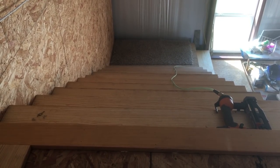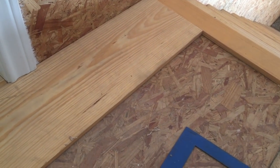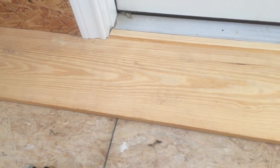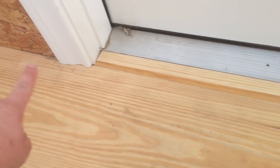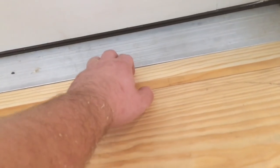Here's looking down — we've got all the treads done. Now I'm working on the landing up top. Unfortunately, this landing was not a rectangle, which is frustrating to work with, but that's part of finish carpentry and that's what makes it fun. We are not doing tongue and groove here because we wanted that big wide plank and we wanted the expansion and contraction gaps between boards, since this is an exterior unconditioned space. We're going in and notching it underneath the trim so that it fits nice and tight against the wall. At a later date we're going to go back with baseboard to really finish it off.